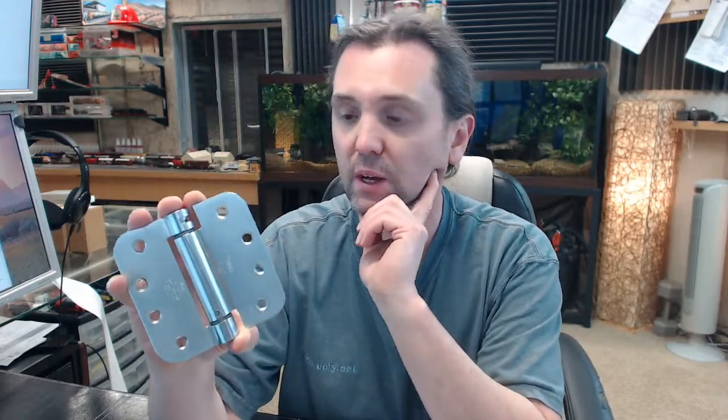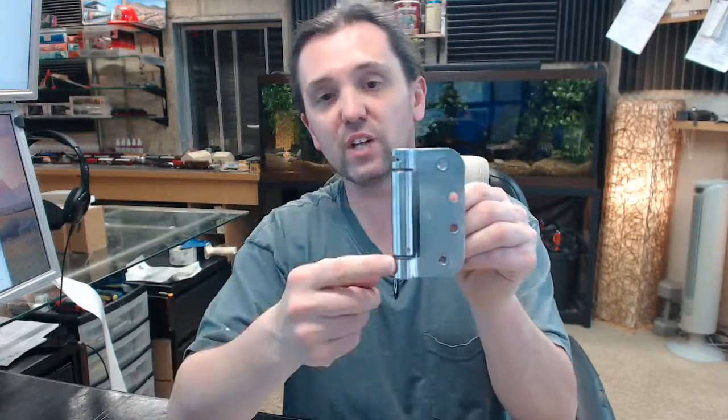So that's an application where a spring hinge would be appropriate, because those doors would always be, or most typically be, fire rated. So as you set the tension on the spring hinge, and we'll go over that in a moment, and the door opens up, the spring hinge has got to get the door from actually a negative action of being opened, stopping it, then getting it moving through the closing cycle, overcoming all that air pressure resistance, building up enough inertia in the door to get it moving as well, but also overcoming the friction of the latch bolt hitting the strike plate to get it to latch.